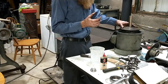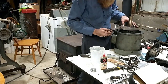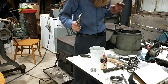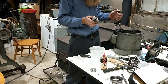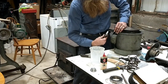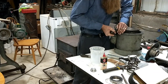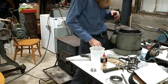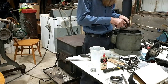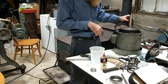So anyways, what's crazy to me is that when you get them off and you clean them up, they drop right back on. It's always rust in there, and that's the part that I don't get. How on earth, in a shop environment, does that rust? It's not like these things will be all crusty. I've never been able to make sense out of why that particular component will develop just ridiculous amounts of rust. That's what I just had to go do before I was on camera: sand the inside of that sheave to get the rust out of it.